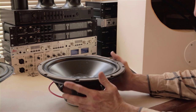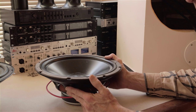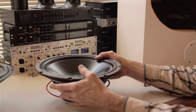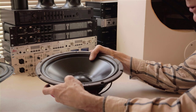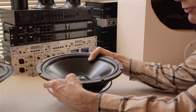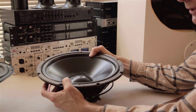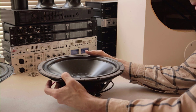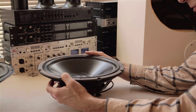Let me talk about whether to choose a 10 or a 12-inch driver. Some parameters I look for: a good polypropylene cone, a stiff cone — this driver has that. The drivers I just bought are actually a paper cone, but it's a very high-quality cone. The other essential for me is a rubber surround — not just because you get a nice Fs (resonant frequency of the driver), but the rubber surround lasts forever. These drivers are 25 years old and they still work great.